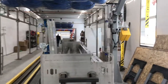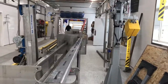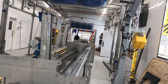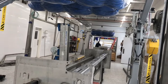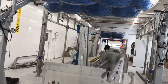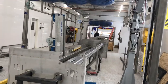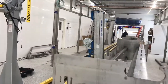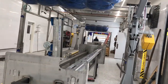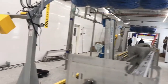Here are the robot carriages. We're going to start assembling them on Monday. We're going to have 3 carriages here actually. One for prepping that's going across the front of the car, the sides, and the back end of the car, pacing with the speed of the conveyor. And then 2 brush robots, one for the front end and the sides, and one for the back end of the sides. They'll both actually do front and back ends when we're not super busy, and they will transform between busy production and slower production.